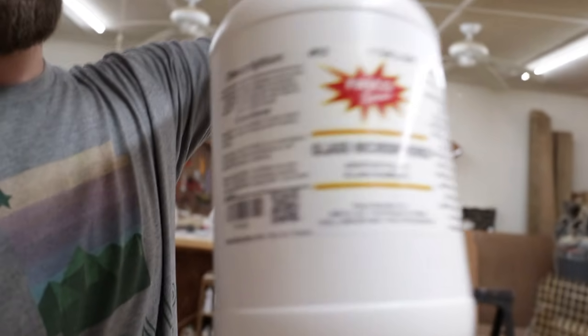Both the top and the bottom are now fiberglassed. Really not a super hard process and I'm happy with the way it came out, other than my little mistake. Overall, fiberglass is really not that hard; epoxy can be a little tricky when dealing with fluctuating temperatures, but not hard to do at all. In the next video on the hard shell, we're going to get this thing prepped and ready for paint. We're actually going to try something new — a product called glass microspheres to create a fairing compound to smooth the surface out. We're shooting for a near automotive finish. Be sure to like and subscribe, and let me know if you have any questions in the comments.